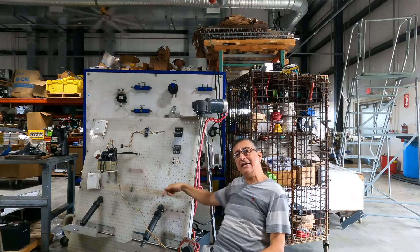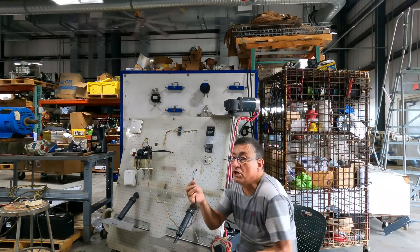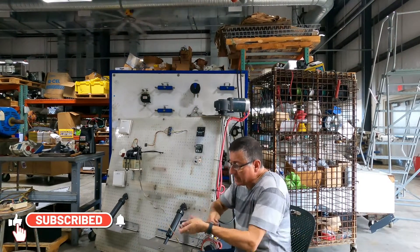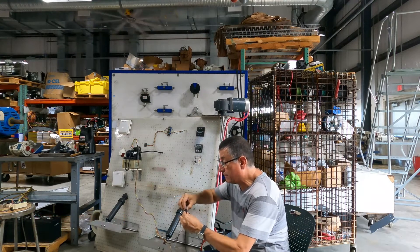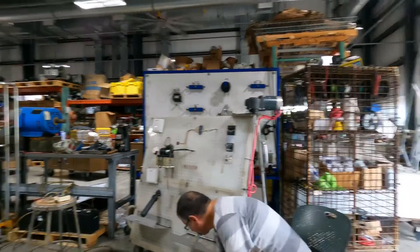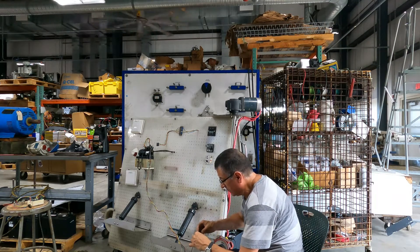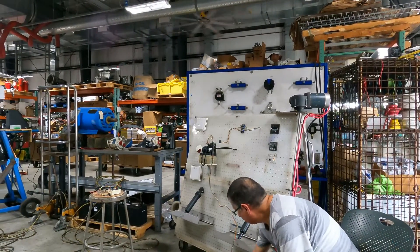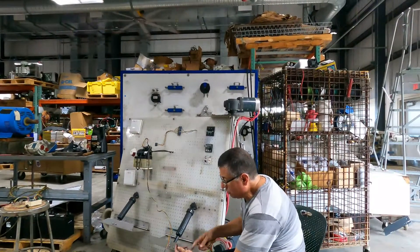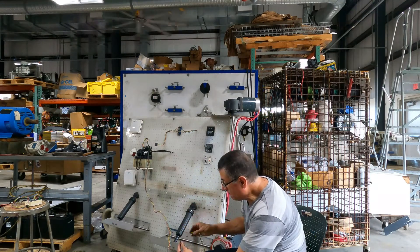The customer says both of them go down. So I'm going to connect power to both solenoids — I connect an alligator cable to both the green solenoid and the red solenoid together and put power in both of them. Now I have power in both solenoids, and I want to check if the motor works. I have the yellow and the blue cable to move the motor clockwise or counter-clockwise, to push fluid or to pull fluid. Let me check — button down. That's perfect. And now up.